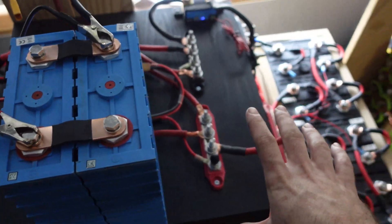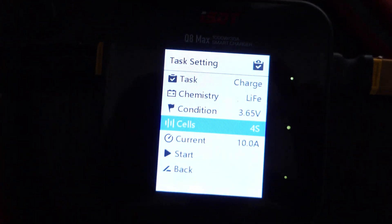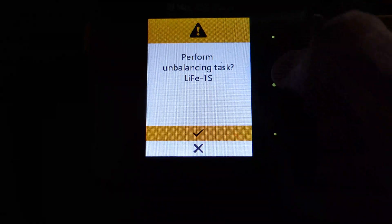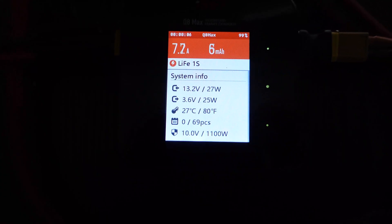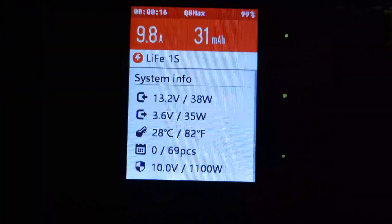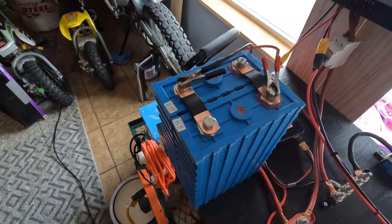Alright, real quick — this is the setup we're going to use. I'm going to use the solar power bank; if you see me using power on my channel, just know it's all from this because I'm going to use the sun as much as I can. We have our ISDT hooked up to it, so we're going to set this to one cell, 10 amps. We're charging — connections are good. We're just going to let these charge up until they're full, then hook them all up, slap a BMS on, build a case, and do some more testing.